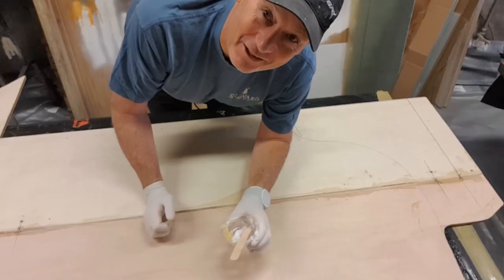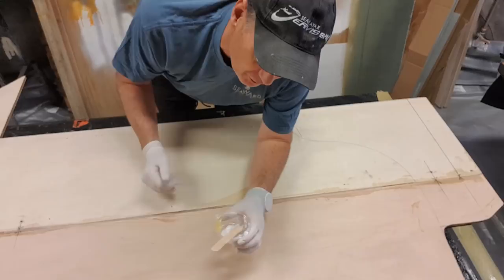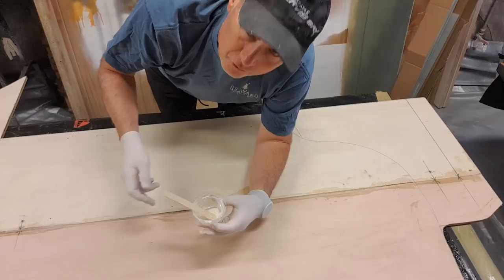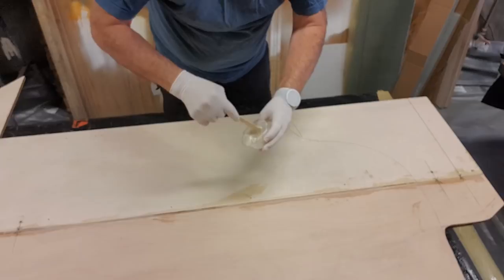By drilling and screwing that batten down, I've got this perfect dead-flat scarf bulkhead. The problem is I've got all these holes. You would never leave a hole in plywood or foam or anything without coring it with epoxy. So I'm going to mix up some thickened epoxy — this is a perfect filler because it has incredible vertical hold as well. It's very good for gap filling, it doesn't seep out, and I'm going to seal every hole in these bulkheads with this epoxy to make absolutely sure there's no chance of water ever ingressing into these pores.